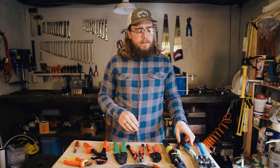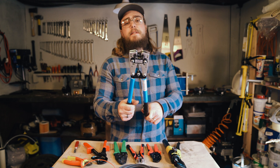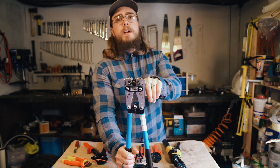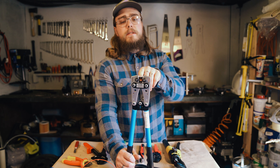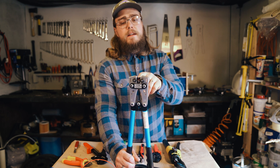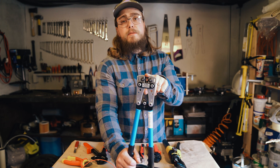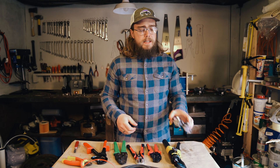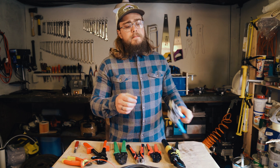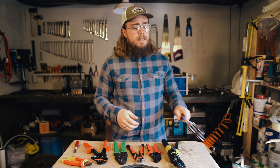You'll probably have seen one of these around — this is just a heavy-duty hand crimping tool that works on leverage. You know whether you have a good crimp by whether the teeth and the dies have closed, and the manufacturer is assuming that once you close to that point, if your connector is good and you've got the right size wire, that should be a solid crimp. I quite like these — they're quite versatile because you can change the dies on the fly if you're working with different size cabling.